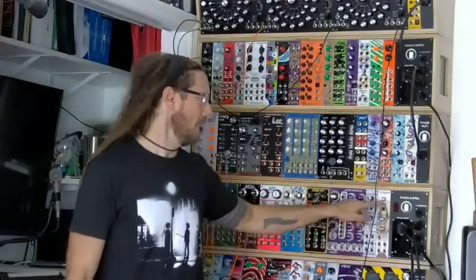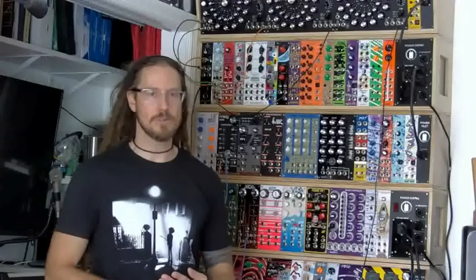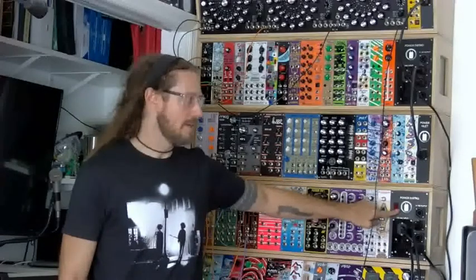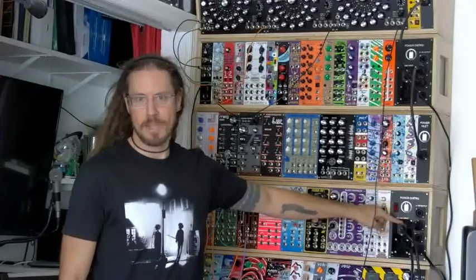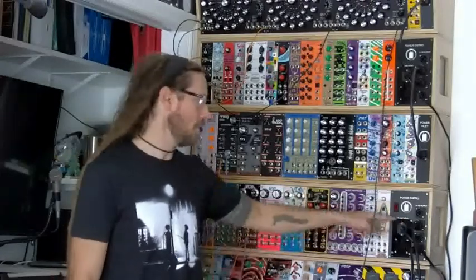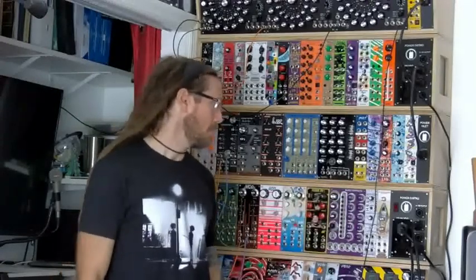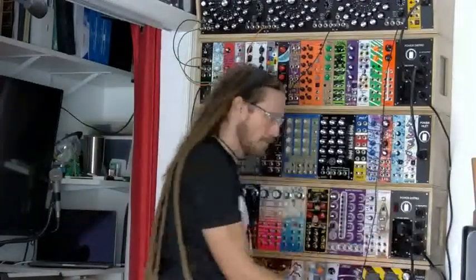Okay, fair enough. I thought that's what I had bought, and I couldn't figure out why it wasn't working. I came to find out finally, I really had to pester the manufacturer to get back to me, the illumination in this is neon, not LED. And the neon illumination takes its tap right off of the common line from the power input. So it's actually incredibly easy. You just jump it right over, but I didn't know it was neon, and it wasn't super obvious to me until I really heard that, thought about it, and then did it right. And now it works.